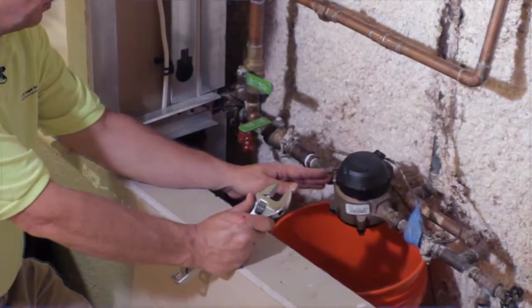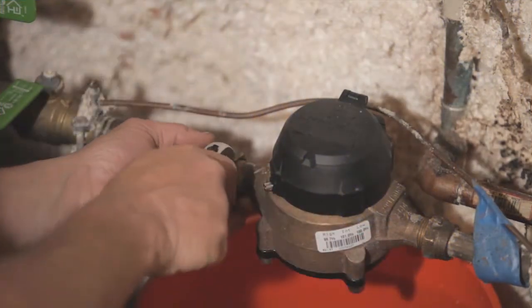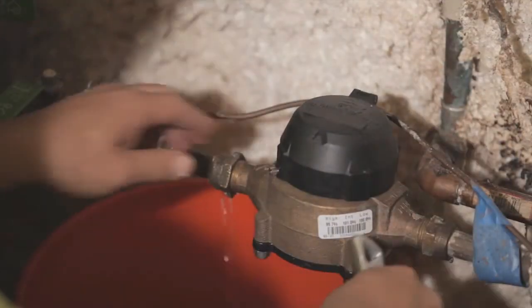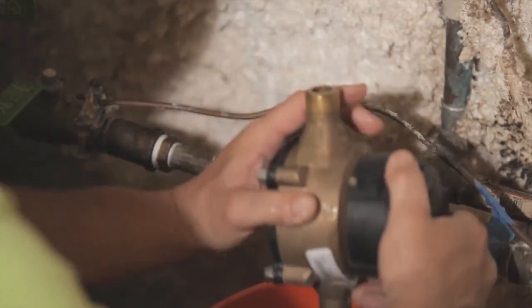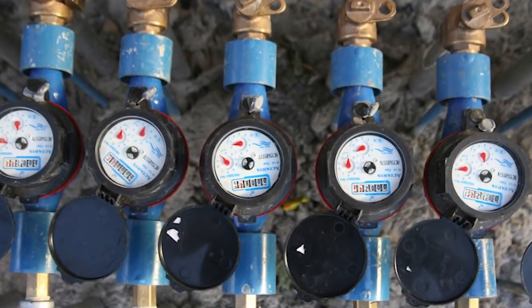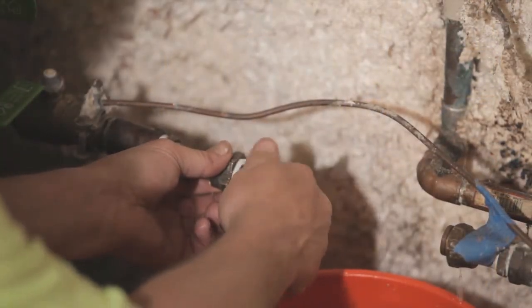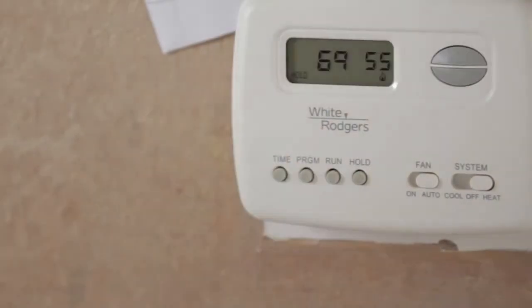Next, you will need to detach the water meter, but first check the water meter removal disconnection list to ensure meters are allowed to be disconnected in the specified city. If a city prohibits the disconnection of water meters and does not appear on the list, provide documentation of this guideline to your VPA or regional coordinator and leave the water meter connected. Water meters should never be removed from a property unless required by the city. If winterizing a condo unit that has a shared meter, the water meter should not be removed. Instead, shut off the water unless the adjacent property would be affected. If this is the case, perform a fixture winterization by turning off the water using fixture valves and leave the heat on, setting the thermostat to 55 degrees.